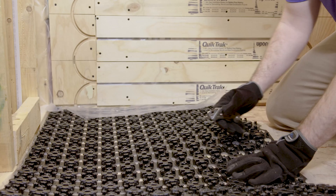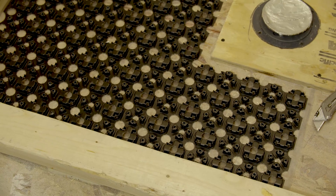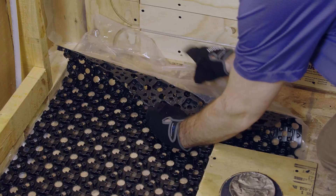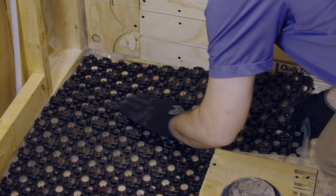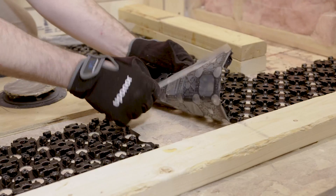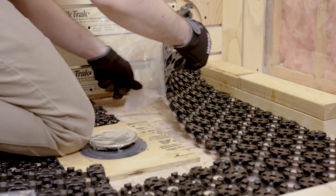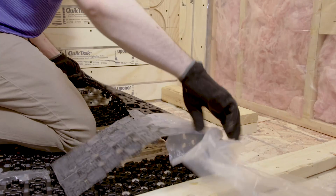Because we're working in a shower bed and using floor mud, which has a clay-like consistency, we won't be needing the fast track edge strips for this application. To install, measure out your area and cut your panels to fit the space. Make sure you're working with relatively clean surfaces so the panel adheres better. Peel off part of the backing to expose the sticky surface and position the panel where you want it, then remove the rest of the backing and stick the entire panel to the surface. Position the next panel using the interlocking tabs, cut to fit, tack into place, and peel off the remaining backing to secure it.